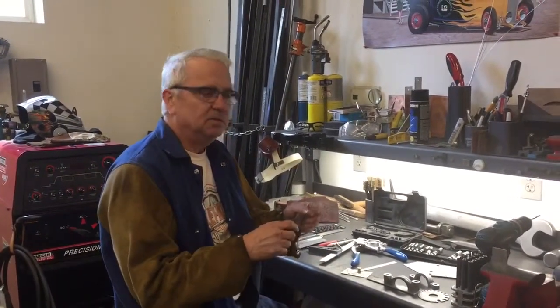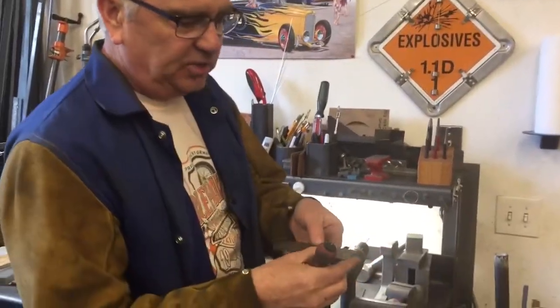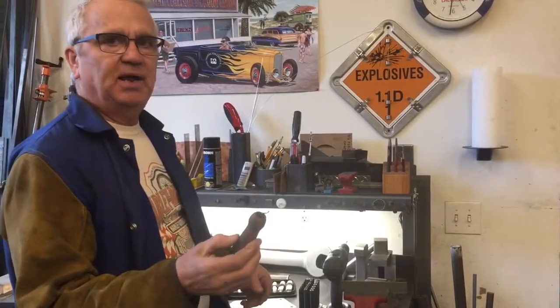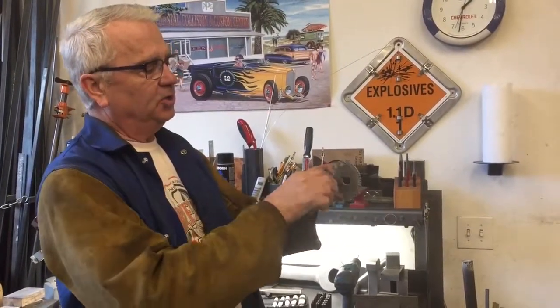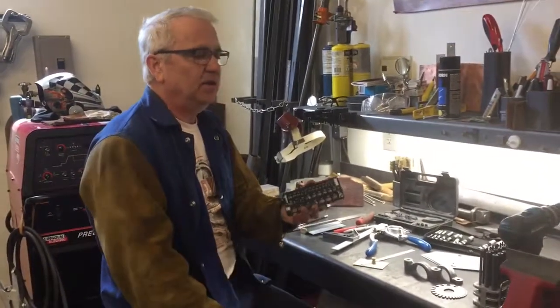This tool is called a deburring tool — a machinist friend introduced this to me and it rocks. Let's say you have a piece of steel with a rough edge after cutting. You put it in the vise and just run the deburring tool along the edge and it rounds it off. It's also great for holes — you bore a hole in a piece of material, roll the tool around inside, and it rounds the edge both inside and outside. It's under ten bucks and I store extra tips in the bottom of it.